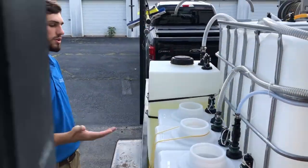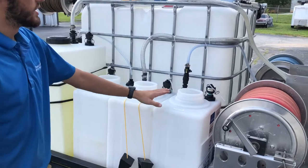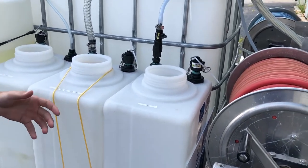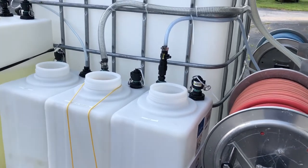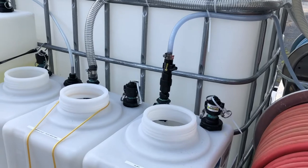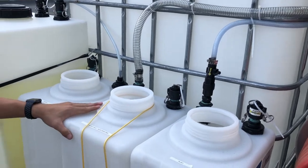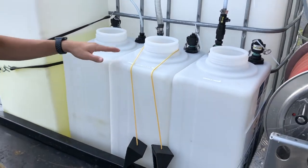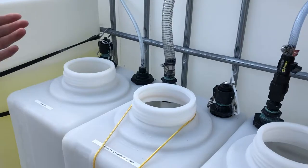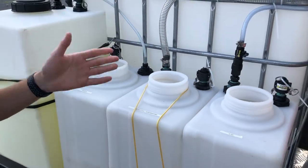As we move around to the other side, we have three 20-gallon chemical tanks that we can put essentially anything in. The first one we use for plant wash — inside it has a slotted PVC that pulls from the bottom to filter. Anything with direct application uses that slotted PVC to pull large quantity. It goes through a check valve to stop backflow or air pockets, then to a micro ball valve into the metering system. The next 20-gallon tank we use for concrete rust remover or wood brightener — again with a slotted PVC filter pulling up through to the metering system.